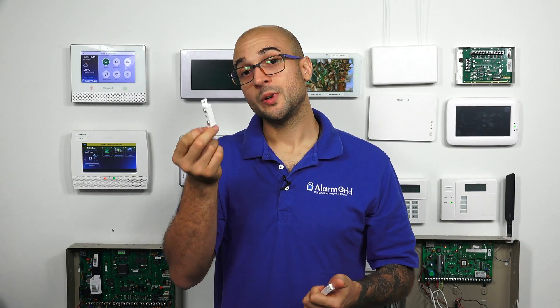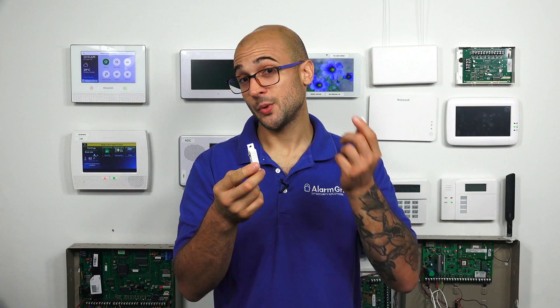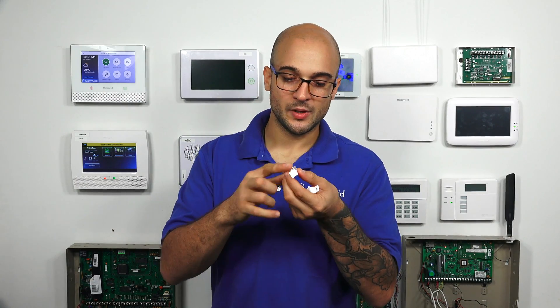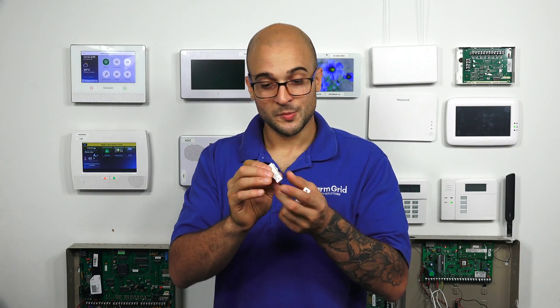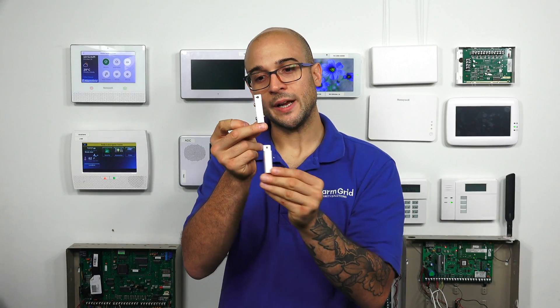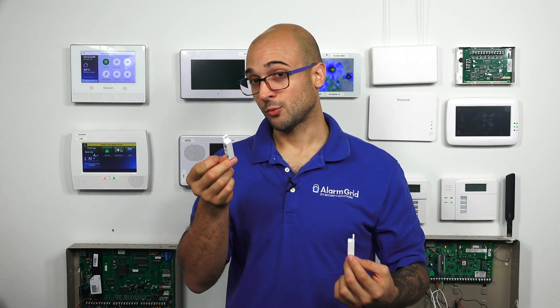Pretty simple, but there's a whole bunch of reasons why these could stop working. One of the more common reasons is that the magnet is simply installed in the wrong spot. The reed switch is only on one side of the contact, and the recommended place for the magnet is on the opposite side of the reed switch. So for this one, as we have our terminals on this side, the reed switch is pointing on this side, which means when we install it, we want to put our magnet next to that reed switch. If we had our magnet on the wrong side of the contact or anywhere else around it, it may not work, and it's not a really secure installation.